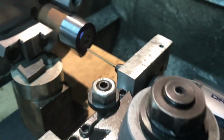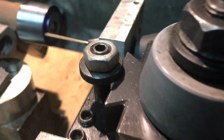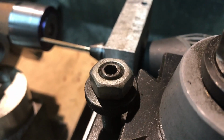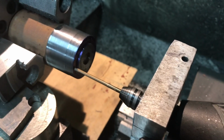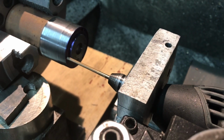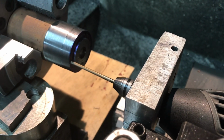And this is another thing I did: I set the Z on the DRO. I'm moving it now. On the very first one, I set it to 0 where it touched, so I can make sure I drill the same depth. I let it go easy at first. I know it's not great technique, but it makes a little pocket and the drill doesn't wander around.